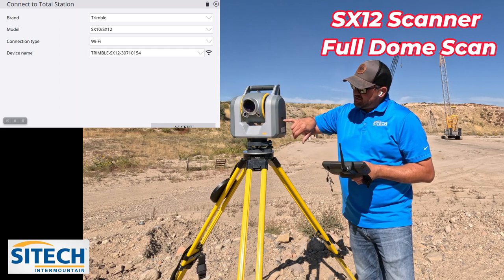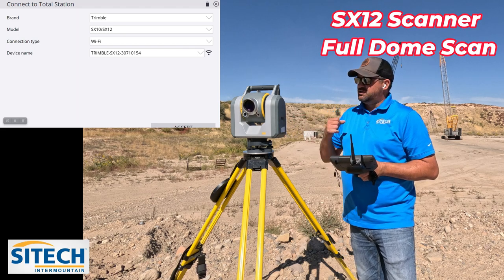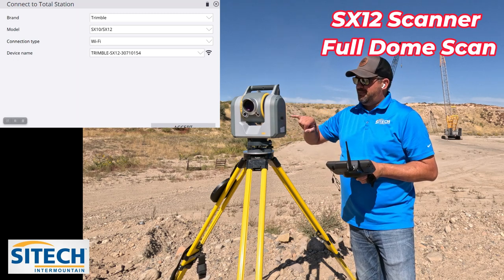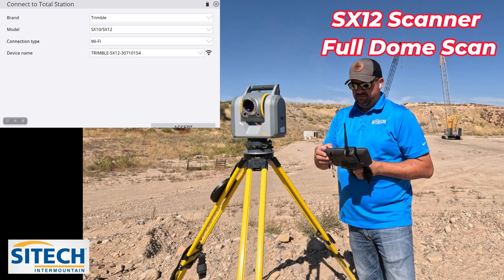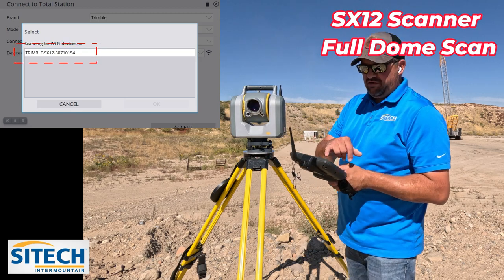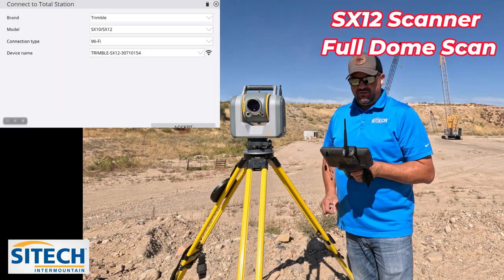One thing to keep in mind is the light on the side, once it starts blinking slow, that means that it's sending out a Wi-Fi signal ready to go. If that's not flashing, double tap that button on the side and it will reset the Wi-Fi option. So we're going to go ahead and hit the scan button and we're going to look for it. So right there's the SX12. It showed up as an option in here with the serial number. I'm going to click on it and hit OK.